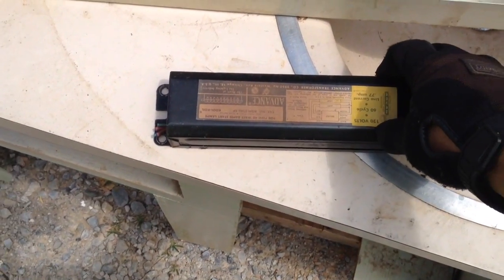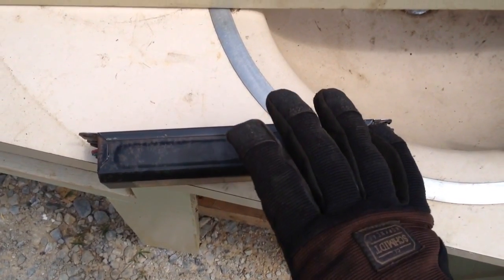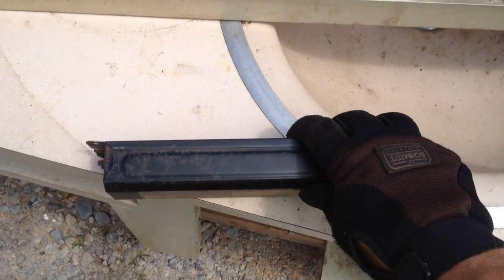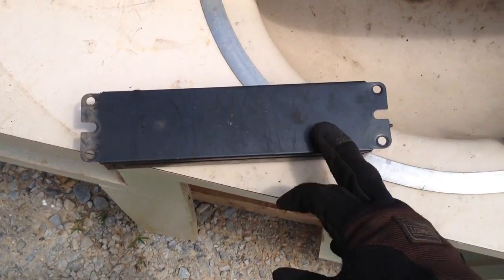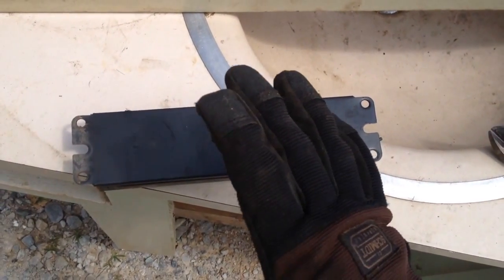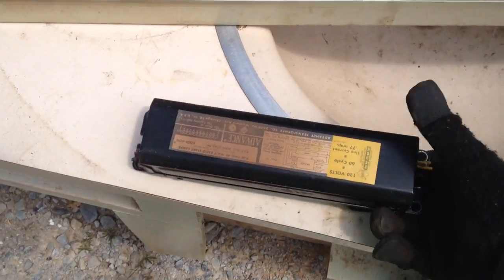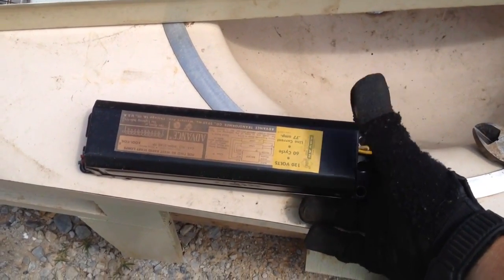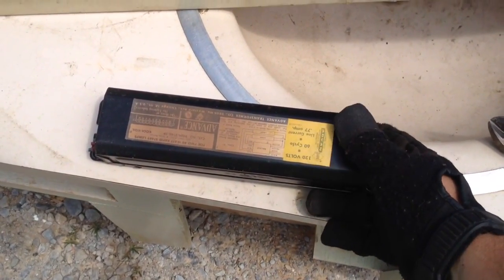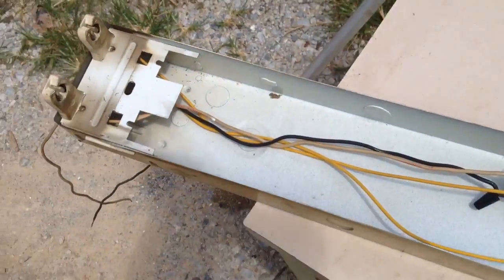To make the encapsulation more brittle in a non-PCB unit, you can stick it in the freezer for a while. Once it gets cold it'll get brittle — just take it out, hit it with a hammer a couple times and it'll all shave off. But again, that's a non-PCB ballast only. We're assuming this one is a danger ballast because it's not marked and we don't know the age, so this is going to go to our scrapyard as a ballast.